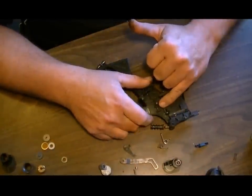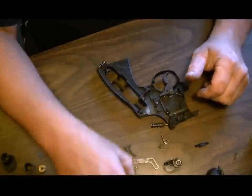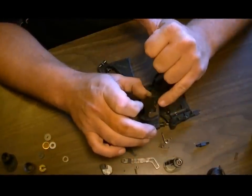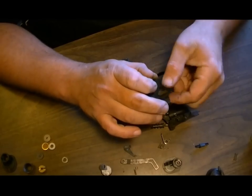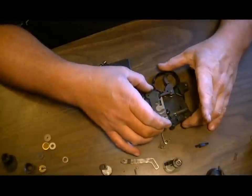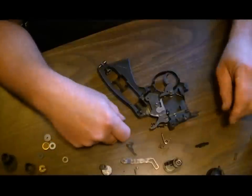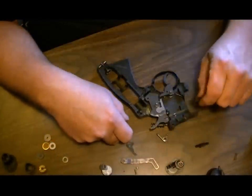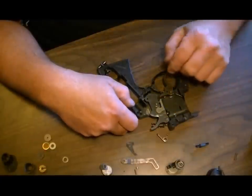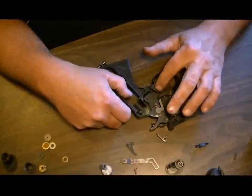Make sure you've got the hammer bar rested up against here where it is. Next you're going to install your hammer. Don't take this apart in here because there's a spring in here and you don't want to lose it — but if you do take it apart, make sure you don't lose the spring. That's going to go right back in just like that. Next part is going to be our sear, and our sear just rides like this. You've got to make sure that it sits where it's going to move — and that's going to move good.